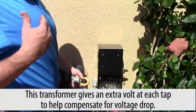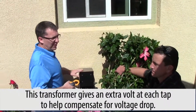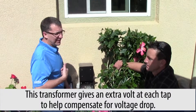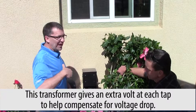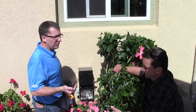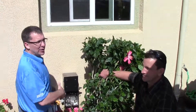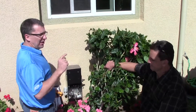Big question: why do we have 15 volts coming out of my 14 volt tap if we're getting just right at 120 coming into the transformer? The answer is we wound the transformers a little hot, meaning we gave you a little extra juice. Every manufacturer in the market does that. This particular model actually has an extra volt built in, because usually you don't read 120 volts — you read somewhere less than that, closer to 110 or 115. So that little extra helps you.